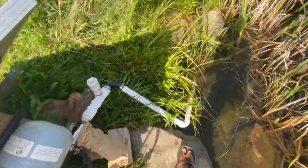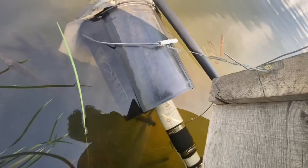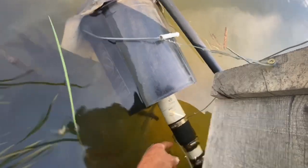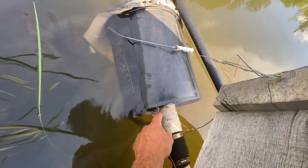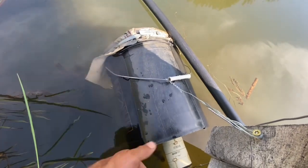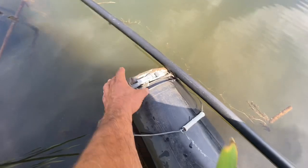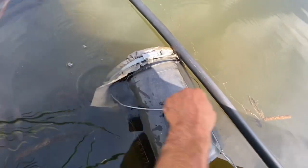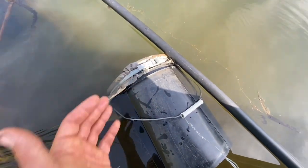I want to show you one other part of the system — a tweak I like a lot. I have the one-and-a-half inch PVC coming in here, and I ran it into a Fernco fitting so I can take this off in the winter very easily with just a 5/16s bit. It goes into a bucket that I hole-sawed through, and it captures the bucket tightly. There's a foot valve in there, which is a one-way check valve to keep the prime from going back out. Then for about eight bucks, this stainless steel fitting has like 200-micron mesh over the outside, and there's a five-micron bag filter inside with a lot of surface area — very easy to change. I can reach over here off the dock, flip this big hose clamp, take it up, clean it off in the pond, and put it back on. That's just going to make the other filter last a lot longer.